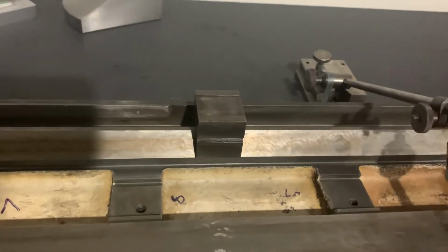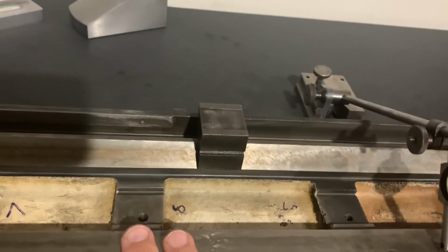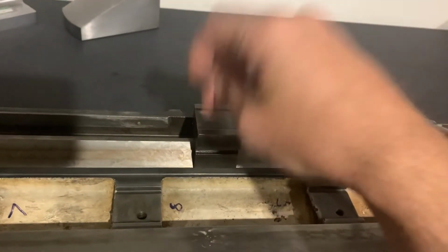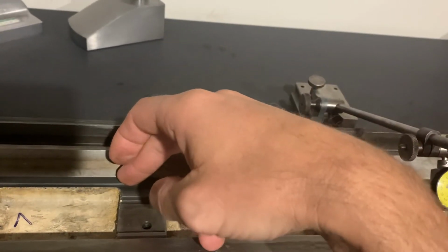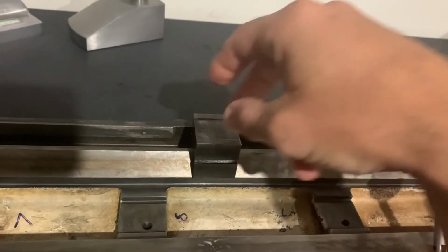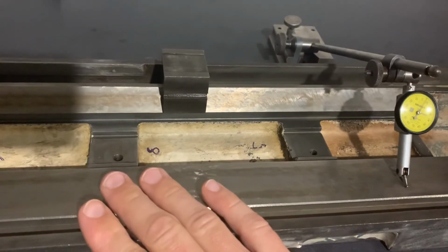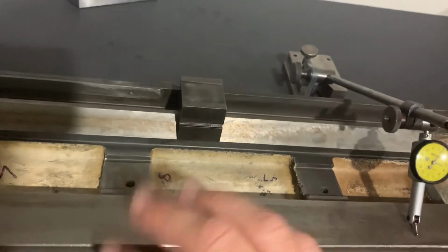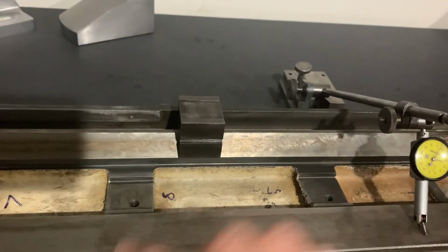What I'll do, I'll just measure it first, and then from there I'll scrape the top in, removing lows and highs, get some good bearing on there, and then check the inverted V first, scrape that flat, check my geometry, tip that in as required. Then the flat, it's easy, make sure that the flat is flat and parallel to the top. I'll do the V's first, because once they're flat, it might be easier for me to tip the top in rather than the inverted V.